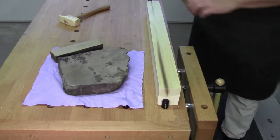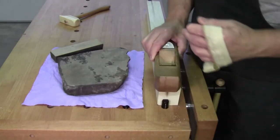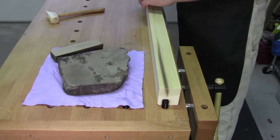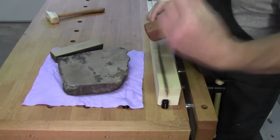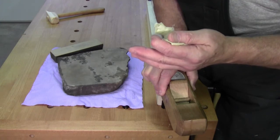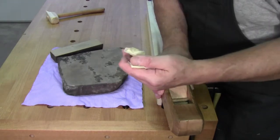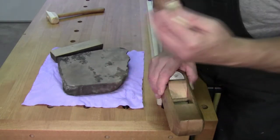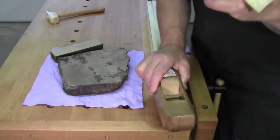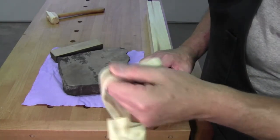So what does that mean? Well, if you are using sandpaper, raise your level of sharpening to a little bit higher grit of paper. Instead of stopping at 220, 240, or 280, take it up to 320, take it up to 400, take it up to 600, take it up to 1000 — but only when the effort demands it.